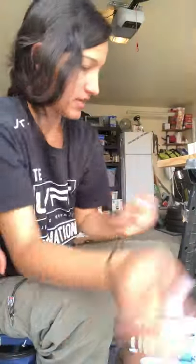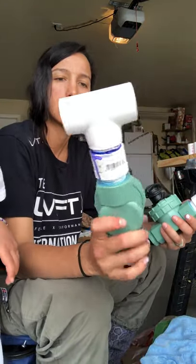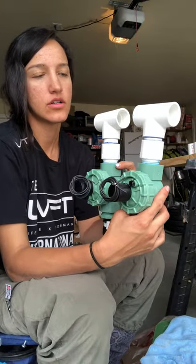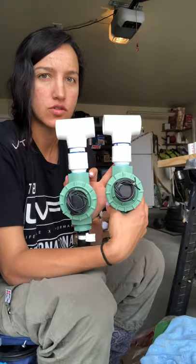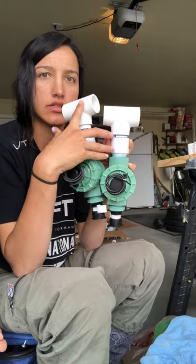Okay, so now that everything I could do was put the Ts on the valves, these are gonna go together in one irrigation valve box. So I'm gonna cut a 1-inch piece to attach these 2 pieces.